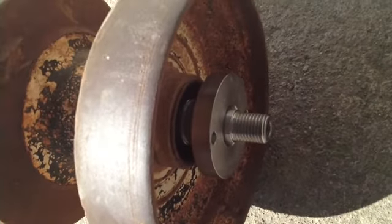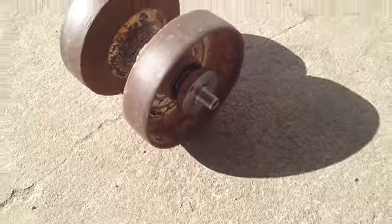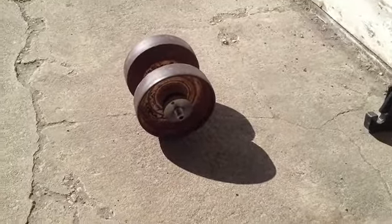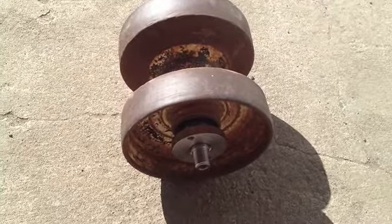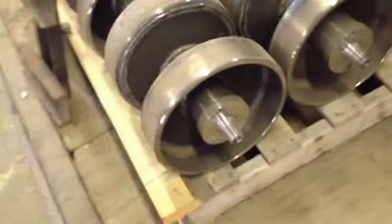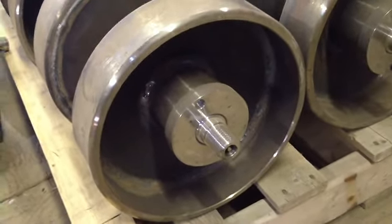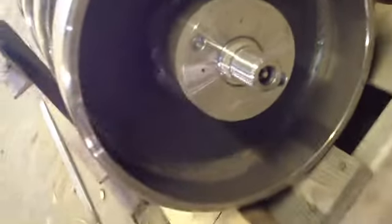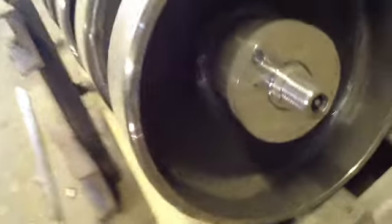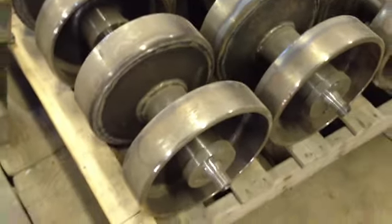We're making a kit where we can weld on a bearing housing, put a couple of bearings in, and then use this to remanufacture a used roller into something that's greasable without having to replace it with a brand new roller. Here we have the new rollers in our paint shop. When they're painted, that's the same shaft and the same end cap that we would use on the old roller. So essentially the old roller would look very similar and have bearings inside, greasable with a grease nipple at the end — reconditioning the old roller without having the cost of a complete new roller.